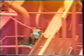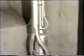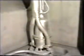Deadweight tons, built in 1994 and equipped with 37 submerged FRAMO cargo pumps. The submerged cargo pump was designed by FRAMO AS in the early 60s and has since then been the dominant system for safe and sound cargo handling on chemical and parcel carriers worldwide, though today the system is being used more and more with great success on crude oil tankers and OBO ships.